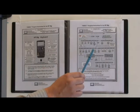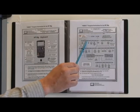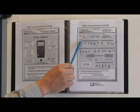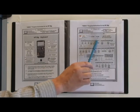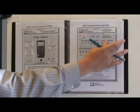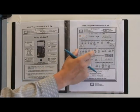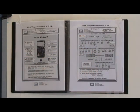This page over here is a very simplified sheet that shows the layout of the menu label keys and the various menus. Like, say, we have the main menu. You'll always find the survey function on the right-hand side, the electronic slide sheet on the left. The use of the next key brings in the next set of menu labels where you change from feet to metric. As you go down, you're going to find all the menus are always locked within the same position. And like I say, the first hour you're going to use this program is going to be the hardest part, because once you realize where everything is and how secure it is, where you can't ruin data, it's going to become very easy for you.